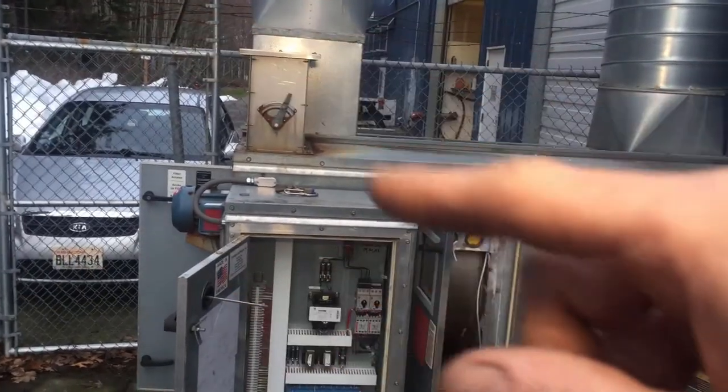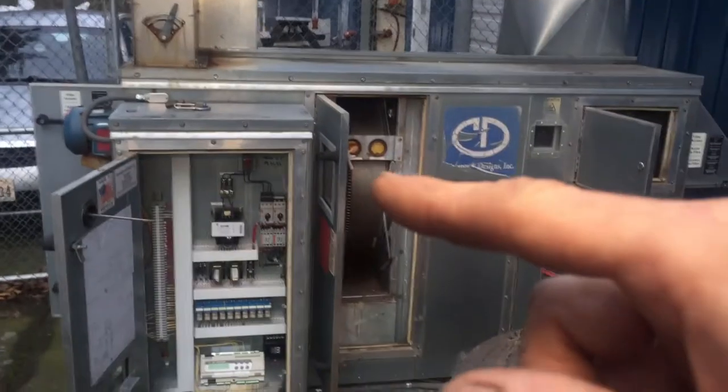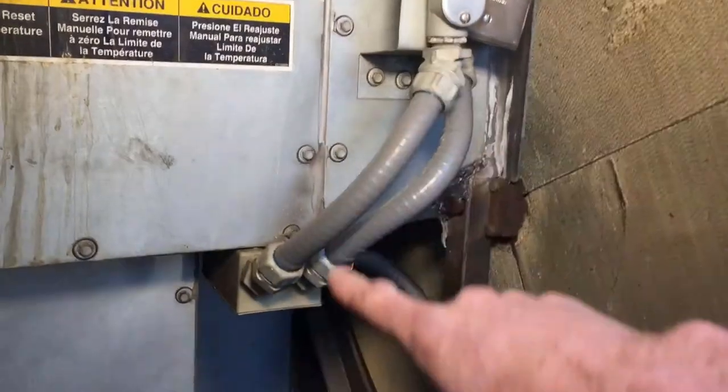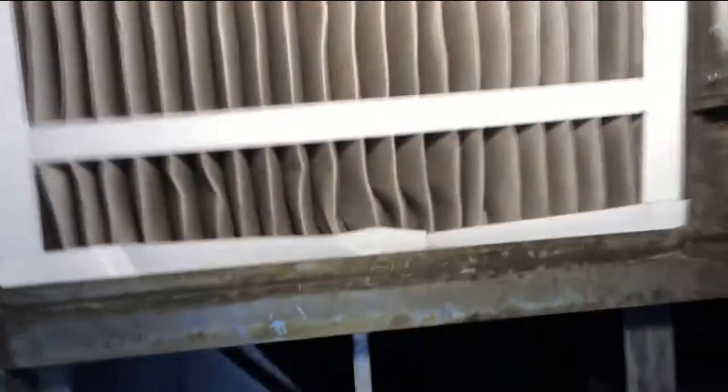Not only is that exhaust air warm from the burner, it's also a little humid from the moisture being released from the wheel. Here's a picture of the desiccant wheel. This right here is the process zone, and this area is where the flame's at — the recharge zone. All desiccant dehumidifiers have this 25% to 75% ratio. The fan or blower through the dehumidifier is right here — it's pulling air from the rink, through the filters, and into the wheel. The desiccant wheel absorbs moisture as the air passes through, and that drier air gets pushed back into the rink via the return duct.